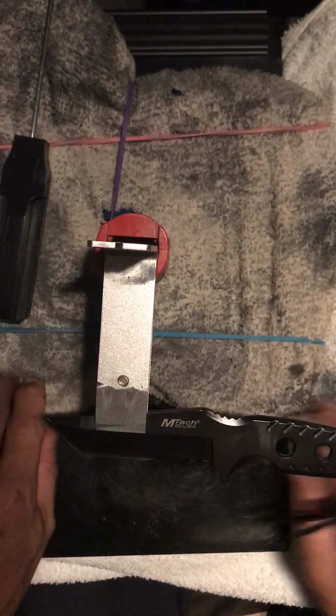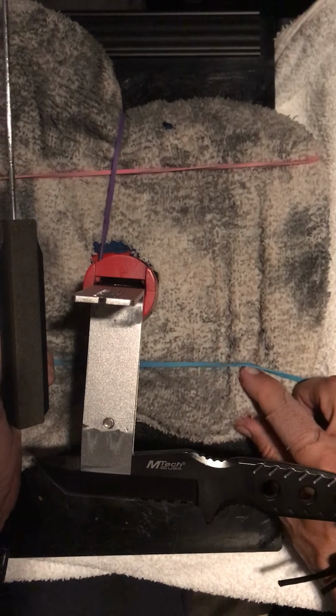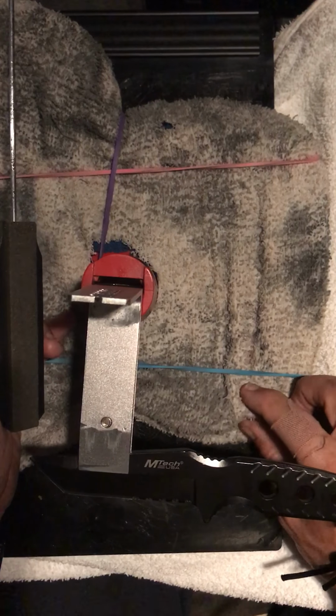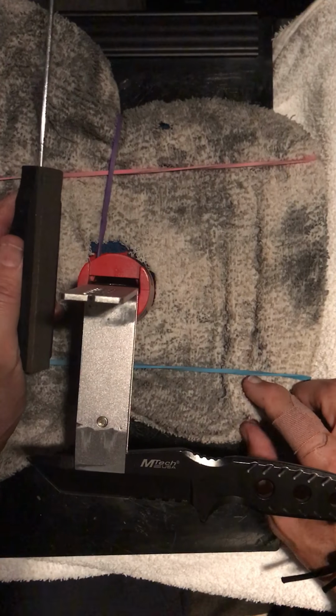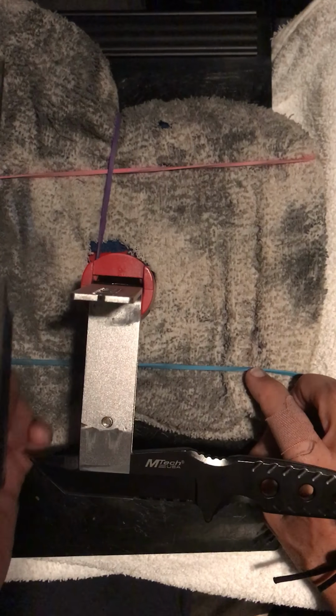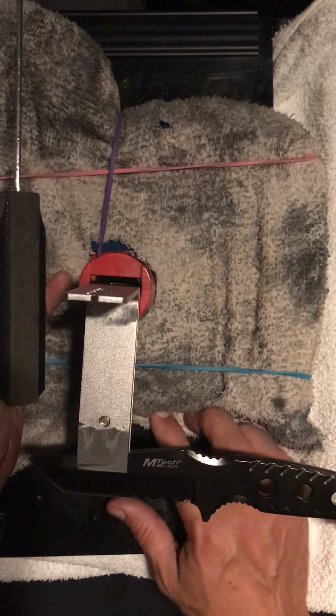What you're going to need to do is do these passes back and forth. On a thick blade like this, it's going to take several passes to come through. We'll start those passes on the next video, but you just saw one pass out and back. Some knives may take 10, 15, 30 passes depending on the quality of your stone, the hardness, type of metal, if you're using proper oil, thickness of the knife. Several things affect how many passes you do.